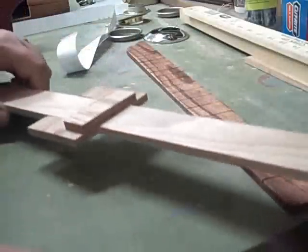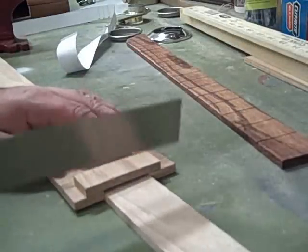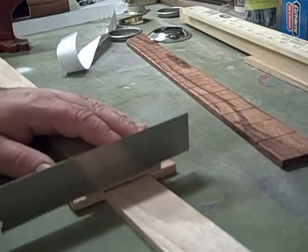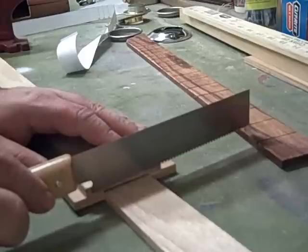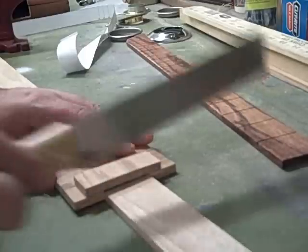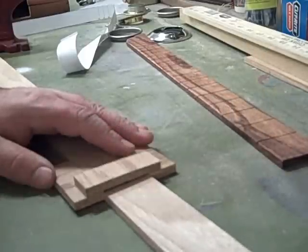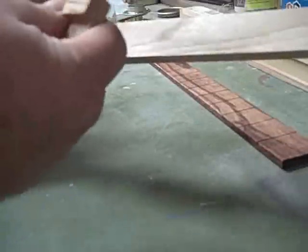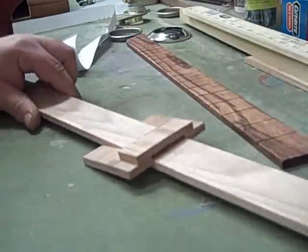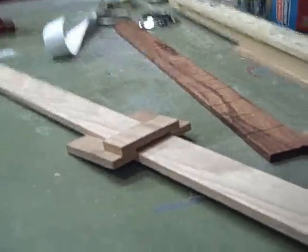The big help comes in with the cutting — the whole reason I made this was to have something to line my blade up against. Now I can just pull and drag, keep pulling until I get the groove thickness that I need. I'll probably make a couple more versions of this, but for me this was free and it has really saved me some time with cutting fret grooves. I hope this has helped — if not, well that's okay too.